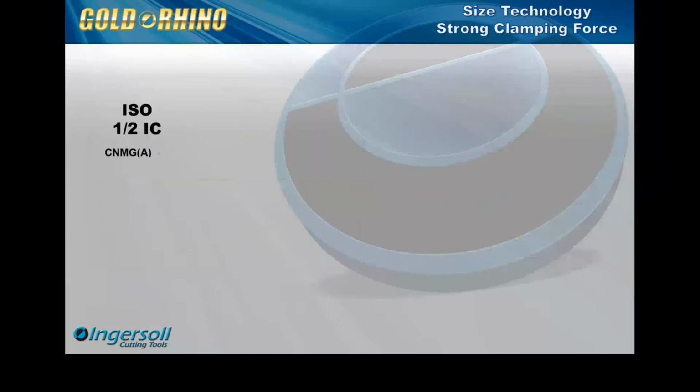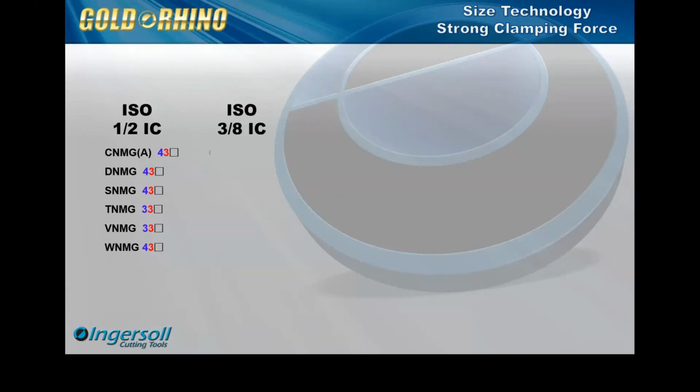So when we looked at the ISO sizes, these are the traditional ISO sizes coming up here, and this is what I consider the 1/2 inch size. And we compare that to the 3/8. Now when I say the 1/2 inch, this is traditionally the CNMG 4s, but the T's and the V's, these are 3/8 size. And so we asked ourselves, is the 1/2 inch size for only an 1/8 inch depth of cut needed? Do we need that big of a piece of carbide for that?